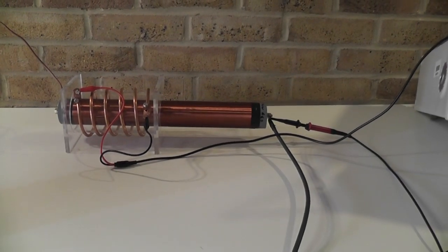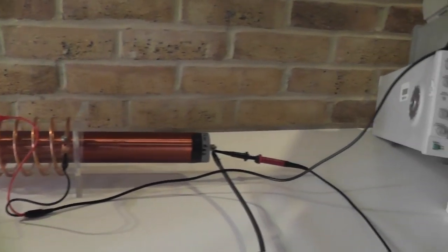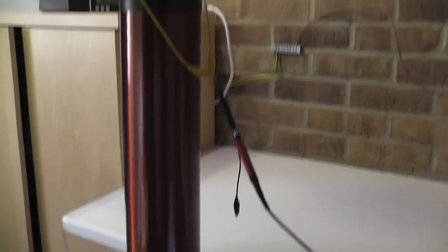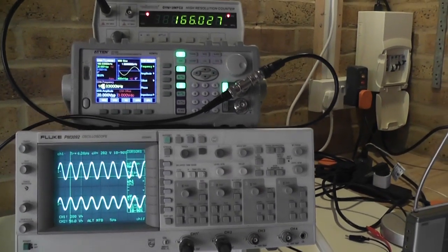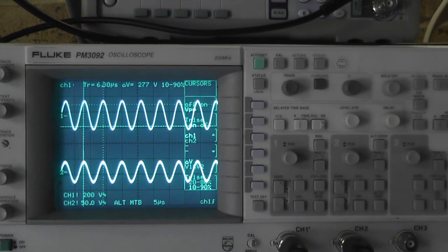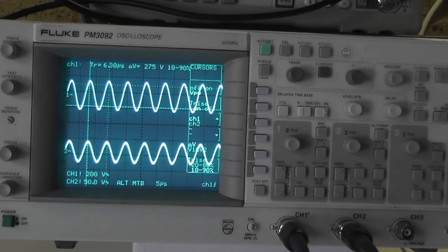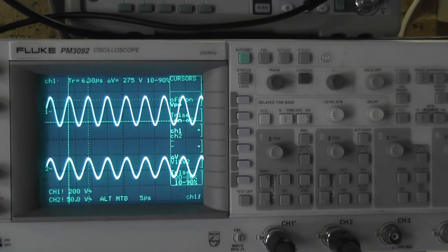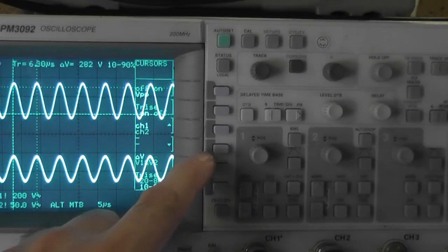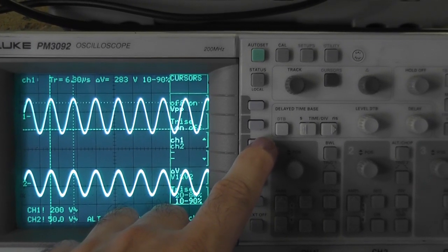Let's start now with the standard setup of a TMT, where you have the driving side normally connected — the ground on the lower bit and the top side where the top load is connected to the bottom side of the TMT part, which is the secondary. That would be the normal setup. I have done my first calibration of the system. On channel 2 I have 54 volts, and on channel 1 it's 260 to 280 volts. Note the value is 275 to 280 on the secondary side, and 54 to 70 volts on the driving side.